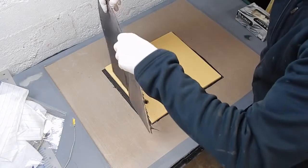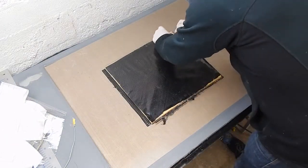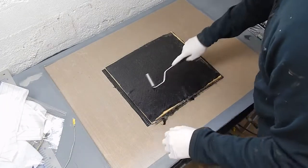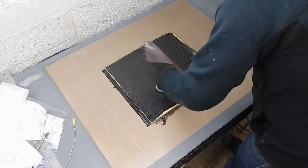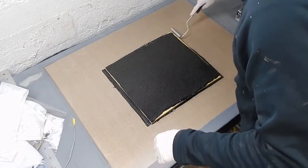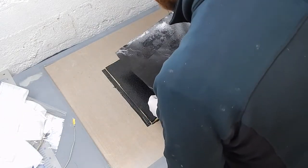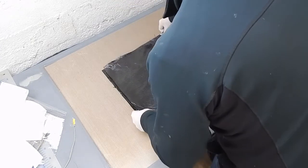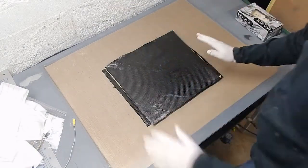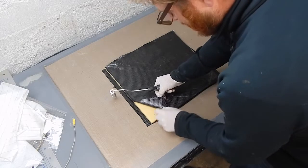That was the two-piece where I had run out of material, so there's plastic on one side and I just had to pull both off the other because it had that little overlap. So now you can see the edges are a little messy. Peeling that up, rolling it, and then I'll do the same with that last ply of 6 ounce twill and peel that plastic off.